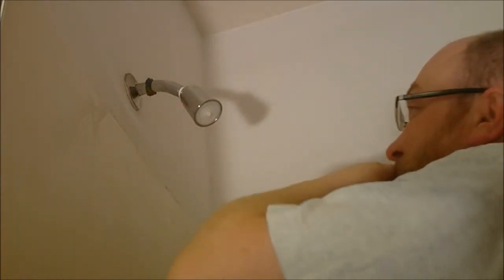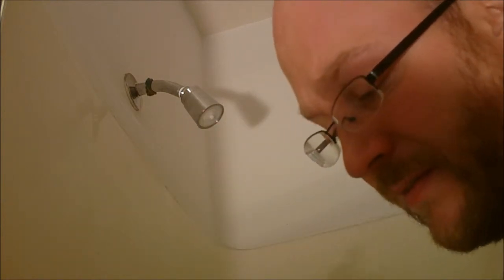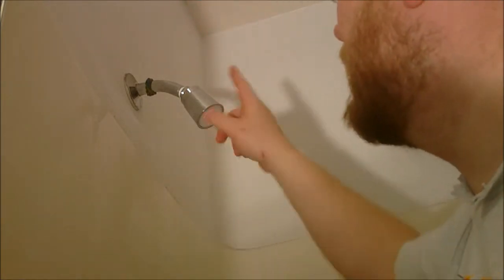This is probably one of the easiest plumbing projects you'll ever do. So that one's clean. What are we going to do with the old one — which is what we would do if you only had one, right? A glass of household vinegar. Stick it in until it's covered, use your toothbrush to clean out the threads and stuff, maybe wipe the outside, let it sit there for a few hours — it'll eat most of that junk away. That's how you take care of a crappy, crusty, nasty shower head. Either replace it or clean it up — and by cleaning it up, it costs you a couple cents. Vinegar's cheap. Don't use balsamic — unless it's all you got, but that'd be a waste of beauty.